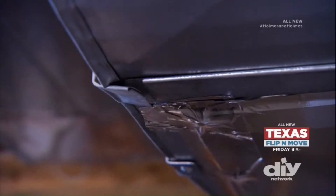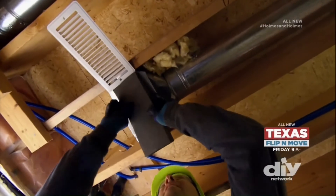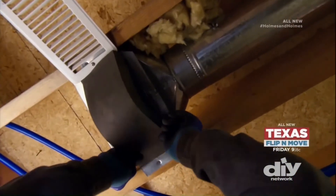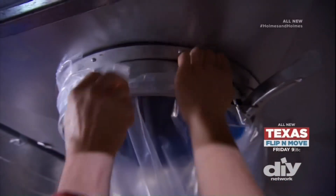And if you give it a ton of holes — which we have in all the cleats and all the joins — there's leakage. Today we're going to use an aerosol sealant that blocks most of the leakage. You're going to block all the registers, force that sealant into all the ductwork, and wherever the escapes or the leakage is, it will fill those holes.